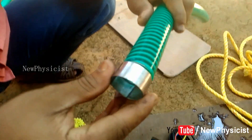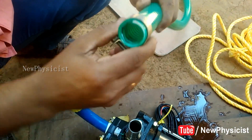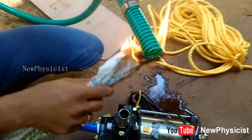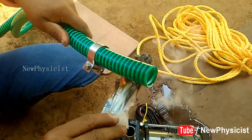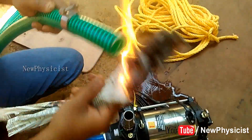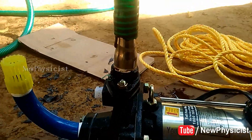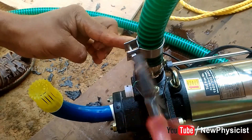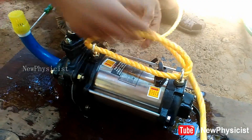The next step is connecting the hose to the hose collar. Insert the hose clip onto the hose. If necessary, heat the hose and apply shellac to the hose collar before connecting. Be careful not to overheat the hose or you'll struggle to connect it. Then tighten the hose clip to make the joint leak-free.